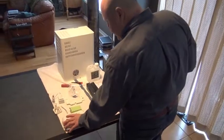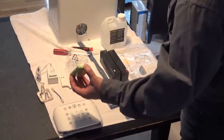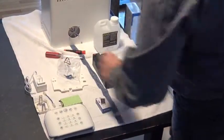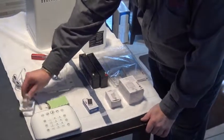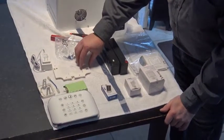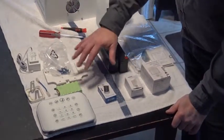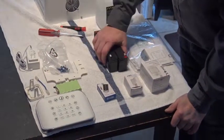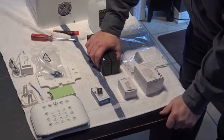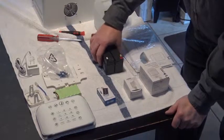Going from left to right: you're going to have the keypad and the accessories required for the keypad, the control or ultra-sync hub for the system. It has a battery for battery backup, which is installed in the back. You have the power cable, which connects the power. You have a locking device to lock it to your power on the wall, and the bracket to hold the keypad with associated hardware for mounting it to a wall. The keypad harness is only long enough to mount the keypad right beside the machine — we've designed it that way specifically. The ultra-sync hub is designed so that no user input is really required with the keypad; it's all done on your remote app or with your key fob, which is included.